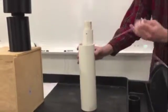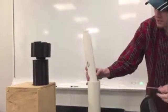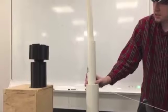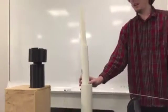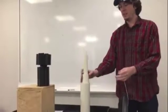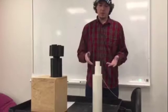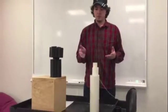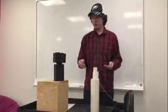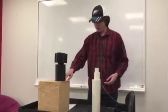As you can see, if you pull this one, the second shaft comes up with the first one, and then you have to hold this second one, which is something we fixed in our final prototype. You can hear the friction, and it's much harder to pull up the second shaft compared to the first one. This prototype was very helpful — we found out that was one of our biggest concerns moving forward, and that led to some of the filleted designs we have in our shafts on the final prototype.